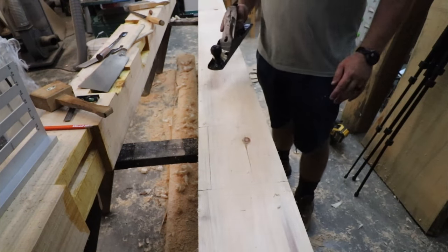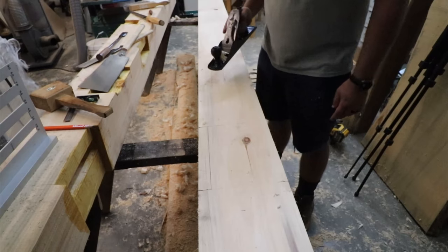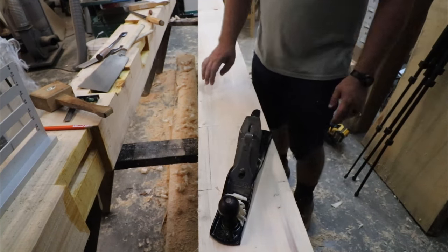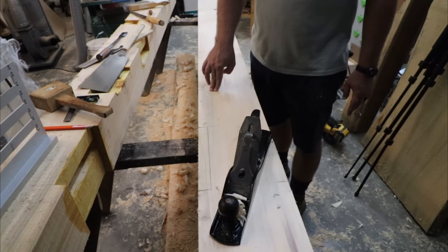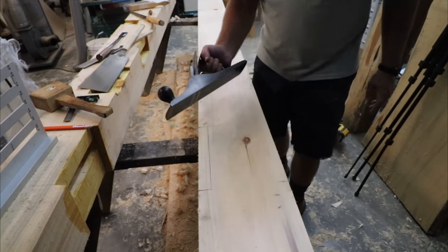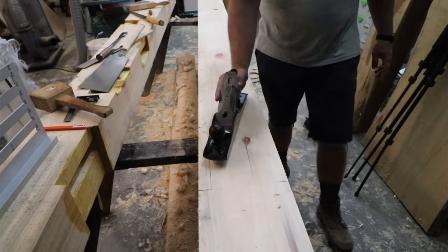What I'm doing here, guys, I'm paying for cutting a corner on the front end. And what I mean by that is this white pine was sawed with a dull blade, and now I'm having to clean it up and make it look presentable with my jack plane. Let me grab the GoPro and I'll show you guys what I'm talking about.